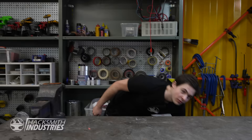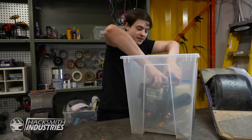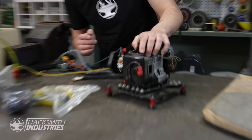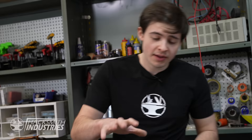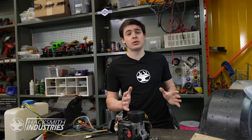We've got our Onewheel, but how are we gonna make this thing gas-powered? Four years ago we bought this two-stroke engine — it's about three horsepower, similar to the ones you'd find on a gas-powered chainsaw. And then on top of that there's a brushless DC motor. The engine spins the motor, charges up our batteries, and our batteries use the electric motor to give itself full torque and full controllability to balance and drive around just like the normal Onewheel.